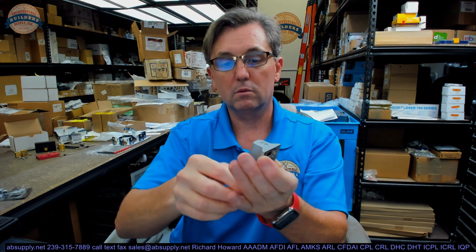You're going to get a couple of keys, is the bottom line. That's going to allow you to unlock, pull that key out, and just pushing it back in, depressing the cylinder assembly, will relock that bolt. You're going to get a couple of strikes here. If you were doing an application where, let's say you were going to mount this in a sliding application where you need, well, a rim, this is what would be called a rim strike. So if you were going to mount this to a jamb and you needed the lock to work in this sort of fashion, obviously unlocked it would move, however you're going to do it if you needed a rim lock.